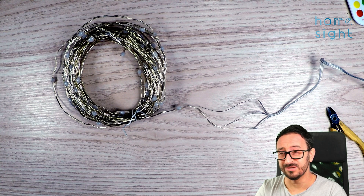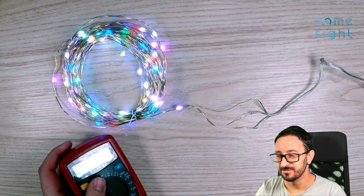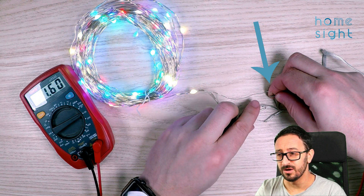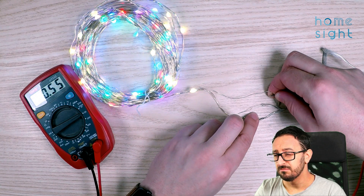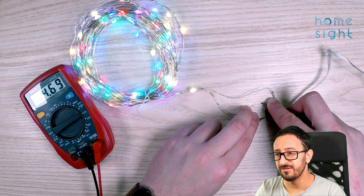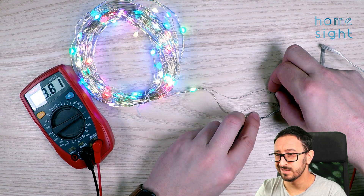A little word of caution: I'm going to bring my multimeter in here. I've actually got the plus and minus leads the wrong way around, so when I mark them up, plus is minus and minus is plus. Just make sure your multimeter is connected up right, because it took me a minute to figure that out. I've now got the power back on. I'm going to put it into volts DC measuring up to 20, and I'm just going to measure between all of the bare wires. First of all I'm getting 0.8 on one pair. On this one I'm getting 2. With USB I'd be expecting something between 4.5 to 5. On this one I'm getting 4.7, and it should be constant - it shouldn't be varying for your plus and minus wires.